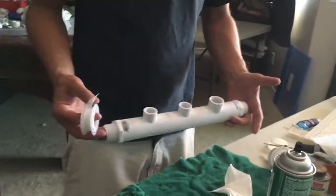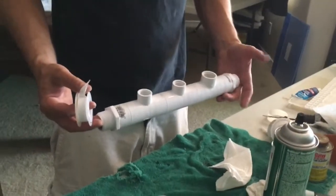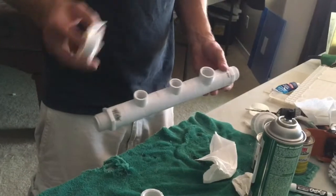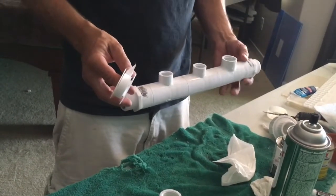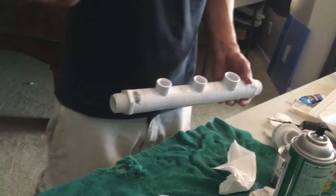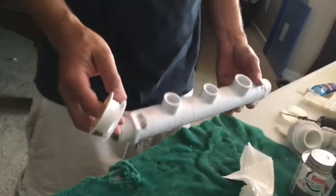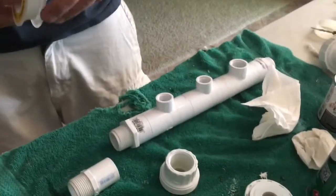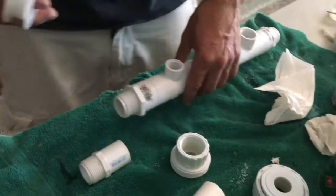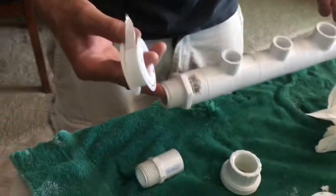Okay so I assembled my ball valve bulkhead basically, and the reason I use pipe thread a lot is because I've re-plumbed a bunch of my systems and if you slip-join everything together, a lot of the times when you first go to make a modification it's junk. So I tend to try and make unions and a lot of pipe-joint fittings so I can reuse the stuff — if I ever remodify this, this can come apart as an assembly and I can use it on another build.